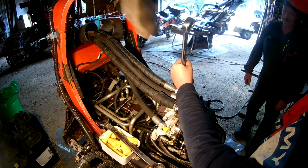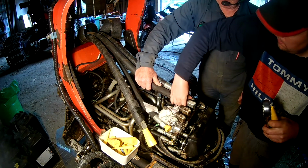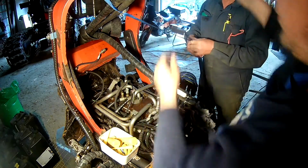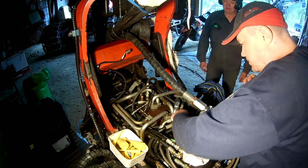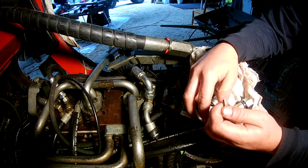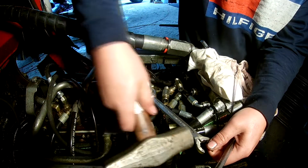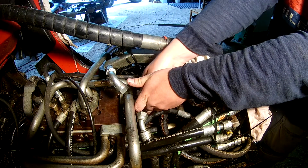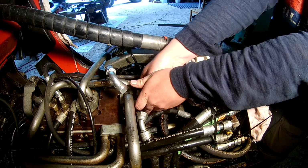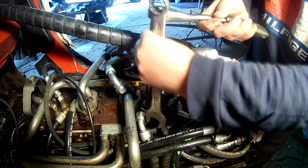So with the harvester head undressed, we loosen the big hoses that are in the way, because I will take off pretty much everything on one side of the valve block here and address some issues, because this was wrenched in this winter when it was leaking quite a bit, and turned out to be that top block that I have a video on. I think that was the root of a lot of the wrenching here that eventually got bad enough that it couldn't really be missed, or well, it wasn't super easy to find, but it was leaking enough that it had to be done.